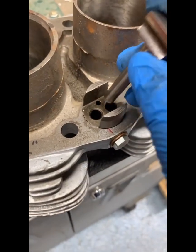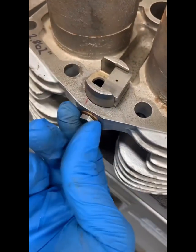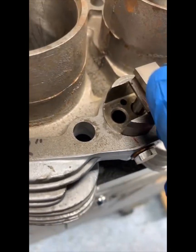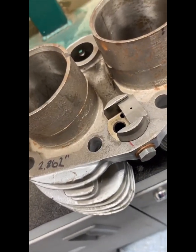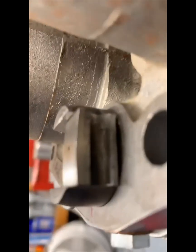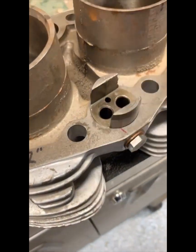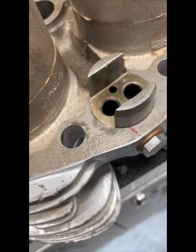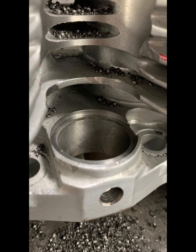Here's what it looks like from the other side — this is the three-inch lifter. Pretty trick. So now I have to do the other side, and then the time-consuming part is I'm going to have to make the tappet blocks. I will make them out of cast iron as original. I don't know of any other 350s that are running three-inch radius lifters — there definitely is a benefit to running three-inch lifters, the factory did it on their race bikes. You can clearly see it's a very broad, very wide shape, and definitely different compared to a standard Triumph. That's the stock typical Triumph tappet block hole, and then this one right here is the Thruxton style, as they call it.